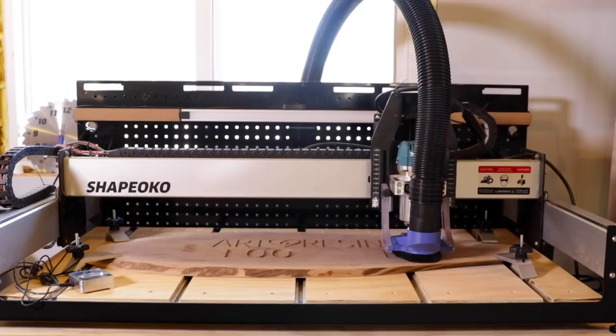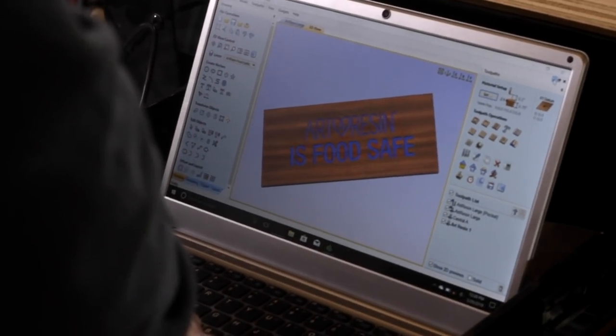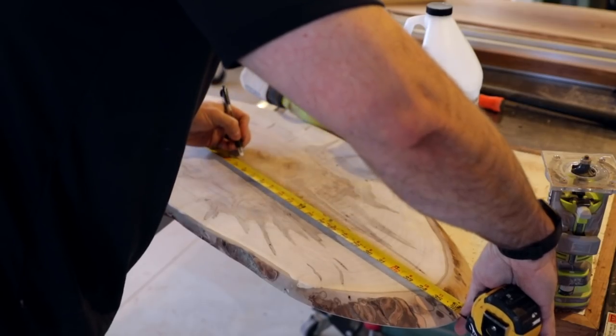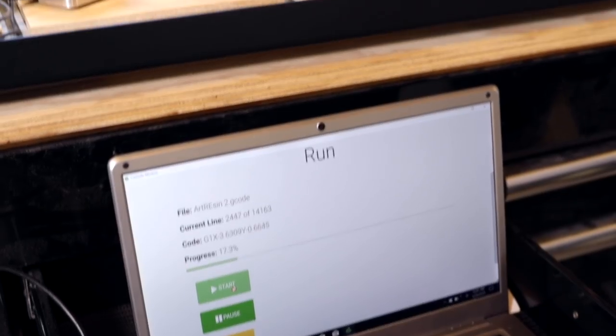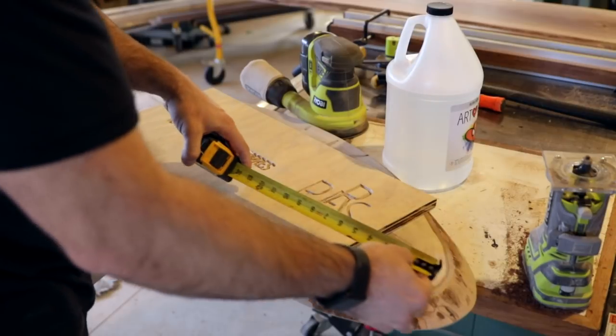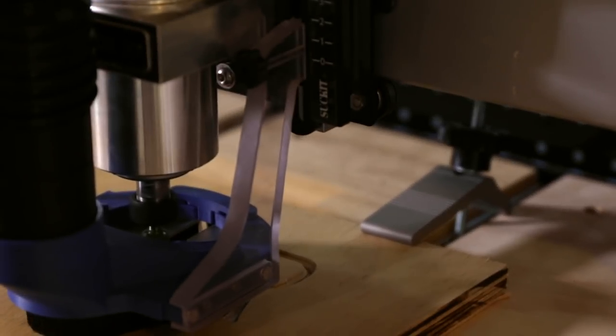Get to the shop — I have a CNC machine. It's fairly easy to understand technology. What it comes down to is asking the client what they want to see on the board, then coming up with a design on a piece of software called Aspire. The software translates it into lines of code that tell the machine to move when, where, and how. You measure out where it's going to fit on the board, find the center point, secure the board to the machine, and tell the software to run. I usually practice on a test piece first just to make sure everything is dialed in before I do the client's board.